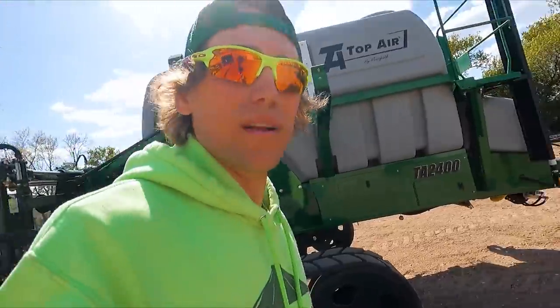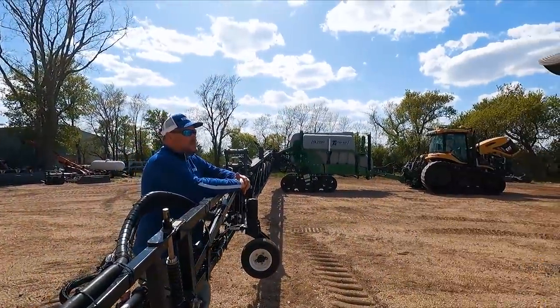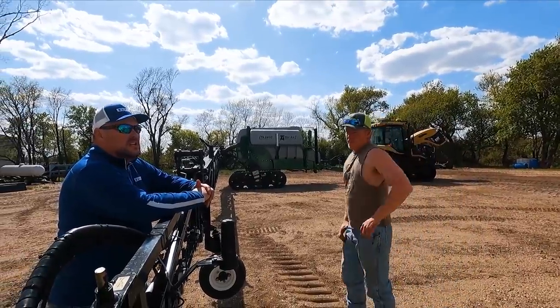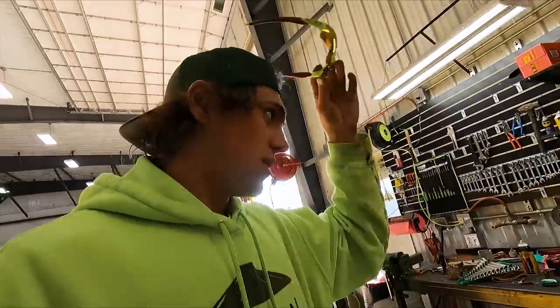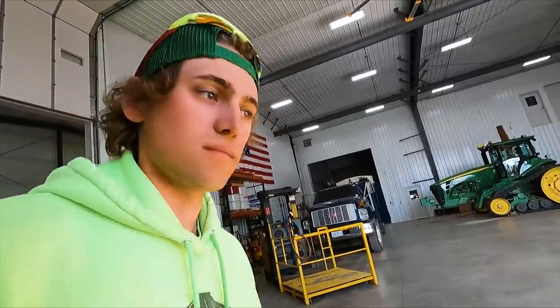We're ready to test fire. Get the monitor set up — we can go up to 30% over. What we're talking about is right behind our sprayer tracks we normally put bigger nozzles in, because the dust there means we need to over-apply a little bit — a lot of it doesn't even hit the ground because of the dust, it just gets carried away. So they can adjust four nozzles behind the sprayer up a percentage, and we need to decide which percentage equals the next nozzle size bigger. That's all controlled through the screen in the tractor.